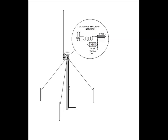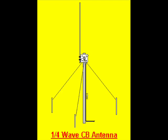There is an alternative network shown right down here. It uses the same coil, but this time it's tapped in the middle, and you use a 150 picofarad capacitor. One side goes to ground, the other goes to the center tap of the coil. This time the coil goes in series with the radiator and the center conductor of the coax, and the coax shield is grounded. This makes a very good homemade ground plane antenna. It works very well and costs very little to make.